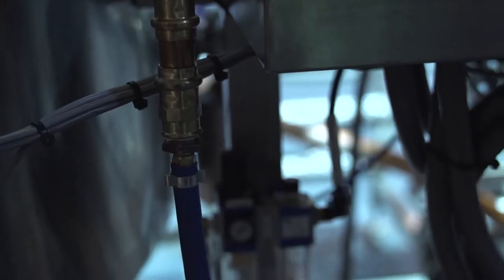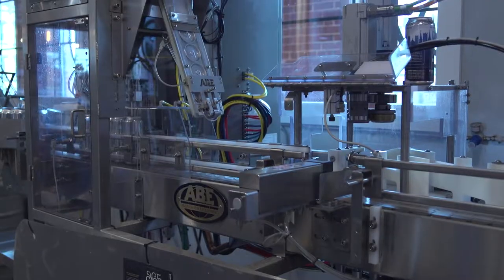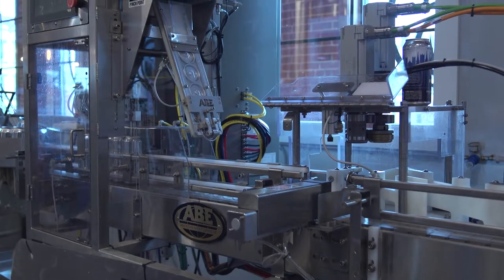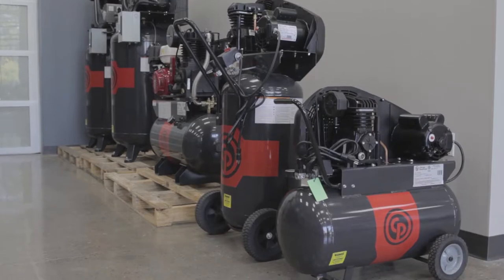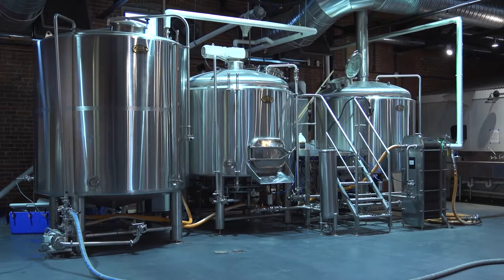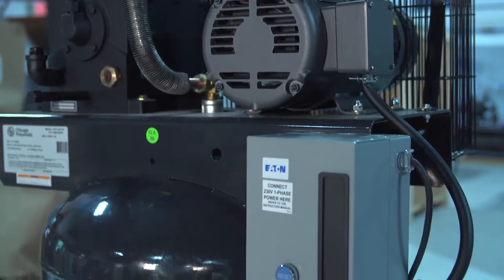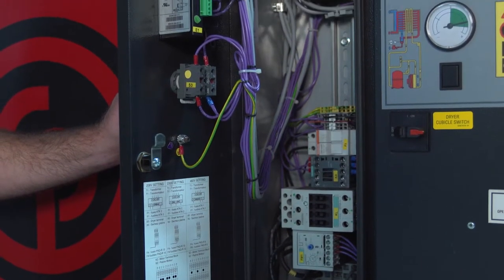When selecting the proper air compressor — size aside — we have to think about the type and quality of air you want. Optimally, it would be good to go with an oil-free style unit, so you really have no chance of any contaminants getting in at all. We also have the ability to do a lot of filtration to help with that. After selecting the compressor type and knowing your CFM totals and pressure requirements, we look at a few other things: how much space do you have, what square footage, is noise an issue, do you have adequate room to work on the unit, and what voltage do you have? Drilling down into those questions really paints the picture of what product we're going to select.